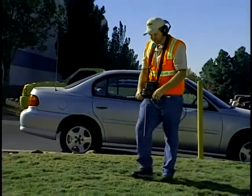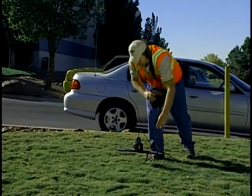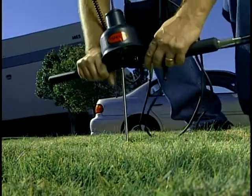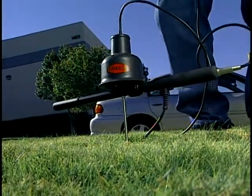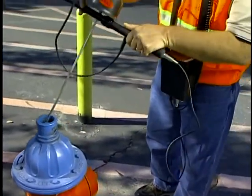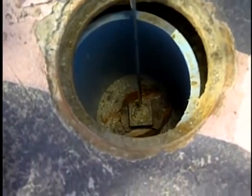When using the multi sensor in hard soil, it is advisable to make a pilot hole to keep from putting too much pressure on the sensor when being pushed into the ground. Do not pound or hammer the mic into hard soil, as you could damage the sensor. Leak sounds may be heard at different locations such as hydrants, meter pits, valves, surface of ground, and underground.